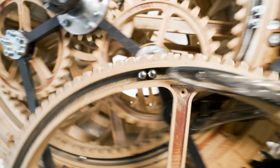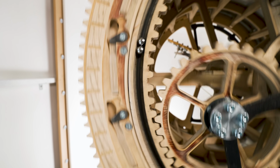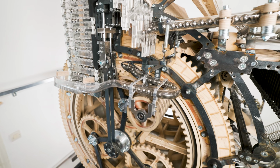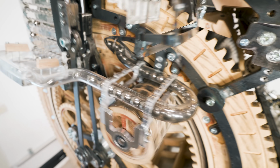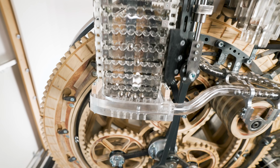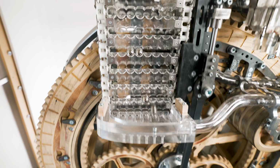The marbles are then transitioning from the first gear into a second gear to lift the marbles even higher. These gears are using magnets to lift the marbles, and we don't want the marbles to be magnetic, so after the second gear, the marbles are pushed through a demagnetizer wheel. On this wheel, the magnets are ordered in an alternate south-north-south-north pattern. So when the marbles are passing over and away from this alternate pattern, the magnetism inside the marbles is totally removed and the marbles are ready to be transported up on the marble conveyor belt.